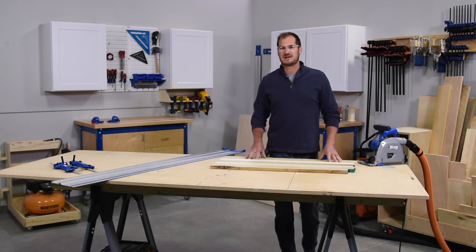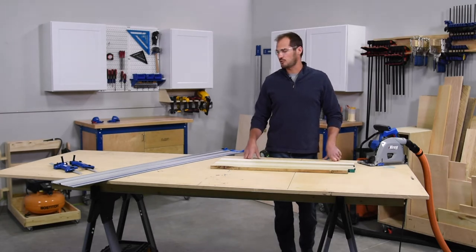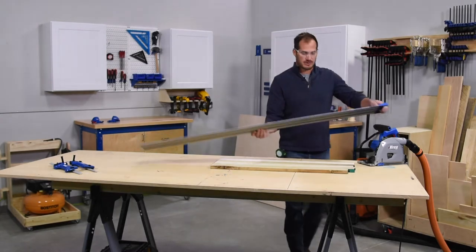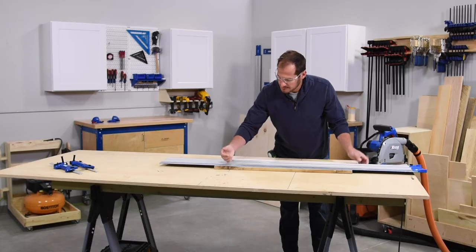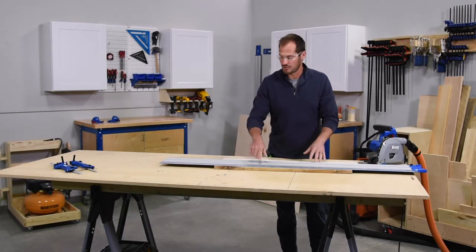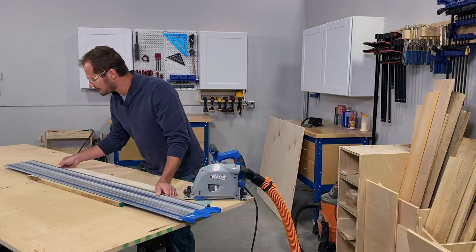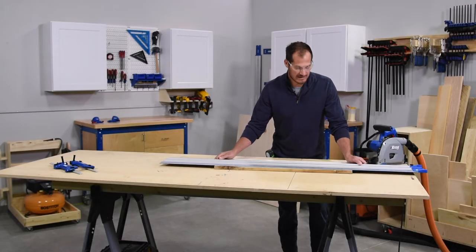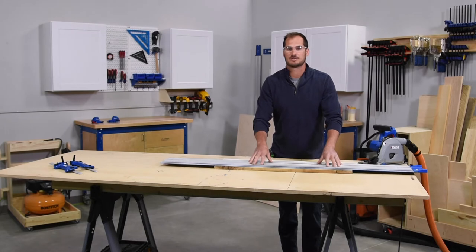I set my material on a piece of MDF to use as a sacrificial surface that I can cut into — it's painted on so it will be replaceable. The first thing we're going to do is grab our track and place it on the board so that our cut line is back far enough to remove all of those imperfections. My biggest piece here is this live edge, so I'm going to bump the edge of the chip strip straight to the edge of the live edge. I want to get my track fairly straight so I can use the maximum width of this board.